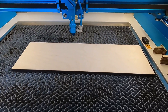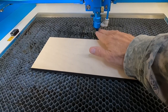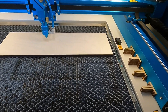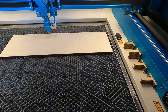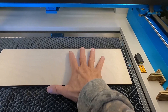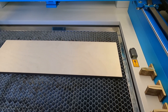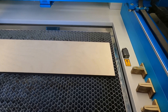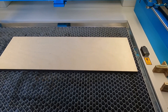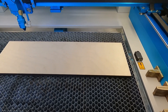Now that you're all done with your pass-through project and you want to reset your automatic focus — when you use your automatic focus, this is going to be six millimeters away from your work. The easiest thing to do is take a piece, whatever it is, drop it down. I always move my head out of the way — always a good idea. I've got a piece of material now, it doesn't really matter what thickness it is, and I have it between these two sensors. I'm going to go to menu, then scroll down to autofocus and hit enter. The bed came up, sensed it, and it's currently sitting where it needs to. I'm going to drive my laser head over this piece of material.